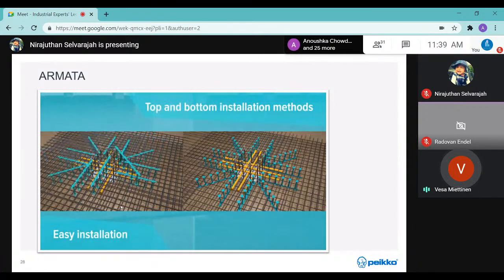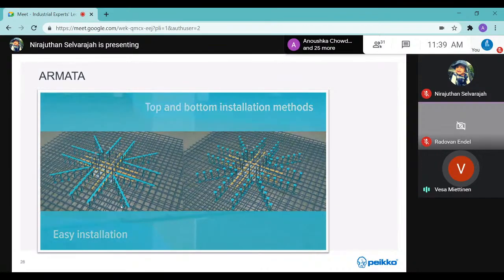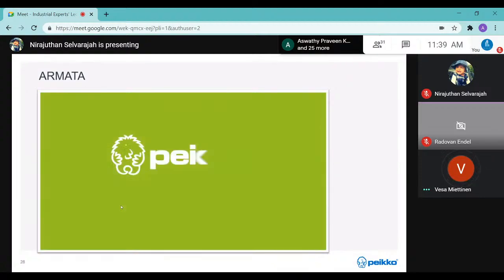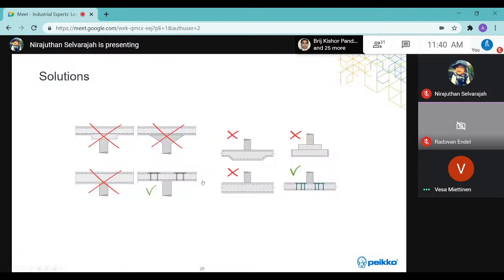So here, it can be a peripheral arrangement, or it can be an orthogonal arrangement of the studs, depending on the design. So this is what you basically saw also on the video. With stud rails, you can optimize your slab thickness if the governing case is punching failure. The same thing we have to remember: it can be used in foundations, where it also gives a huge benefit.